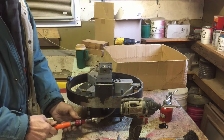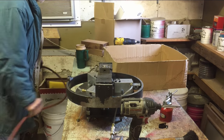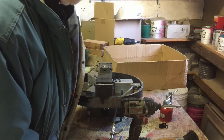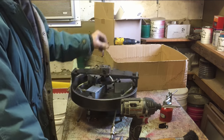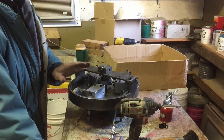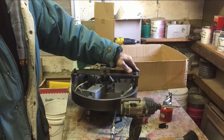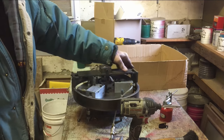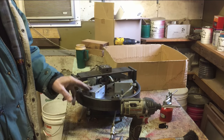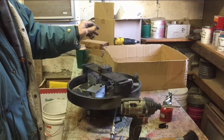No leaks anywhere — that's good. The pressure I'm running right now is about 130 psi, and when it's actually running it'll probably be on like 200. It's an inch-and-a-quarter cylinder, so for every 100 psi you get roughly one and a quarter times the force — so at 100 psi you'd be getting about 125 pounds on the piston pushing the O-ring to the oval.